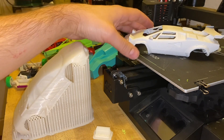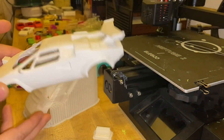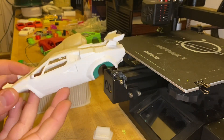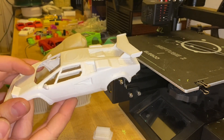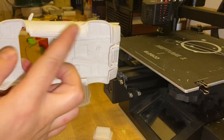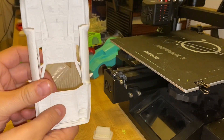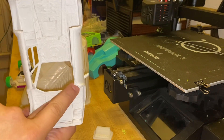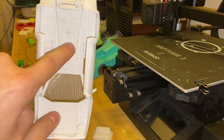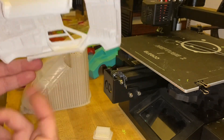This is also true for horizontal prints — and bear with me, this came out pretty crappy, but the file is actually good. It's just crappy filament that I used. I will typically go around the rim with the support structure and in cases like this that has a big opening for the windows, I will put support around the rim of the window and around here, because otherwise this would be a low-hanging fruit.